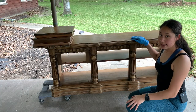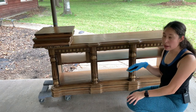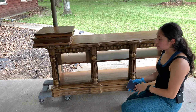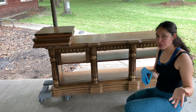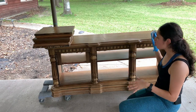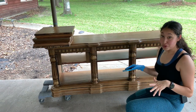I'm going to go ahead and start scuff sanding, but I am going to be using a sanding sponge and sand everything by hand because there's too much design around here. I don't want to take out the sander, do half of it with the sander and do the rest without it. So I think it's just easier if I just use a sanding sponge, and then we're ready to start painting.